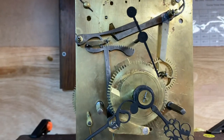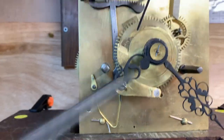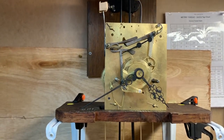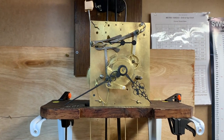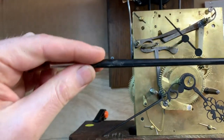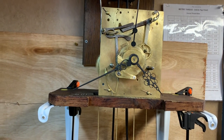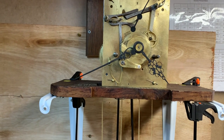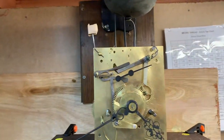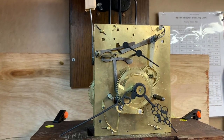You've got a few things to set up on a grandfather clock. The rack is very important - you set that up to where it's going to be. When we're working on striking problems, we go right round checking it strikes correctly, because there's a curve in your rack - it's not a straight line. We've found that sometimes going round we get to five o'clock and then six o'clock struck seven. If it gets too far advanced by 12, it's going to jam the rack up.